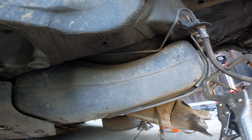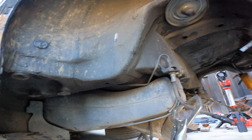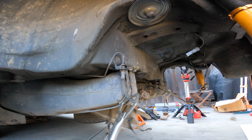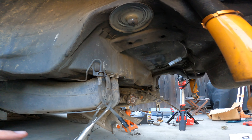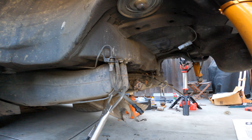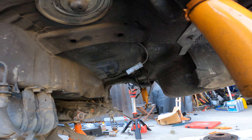There is something on this car still — the gas tank. If you're not comfortable welding with a gas tank on, I recommend removing it. My gas tank is very empty, so I may drop it or just stuff a welding blanket up in there for deflection. I don't have any leaks or excess fumes, so I may just weld it under the chassis.